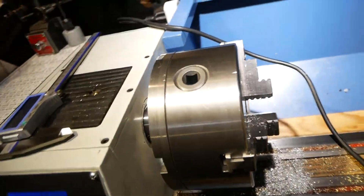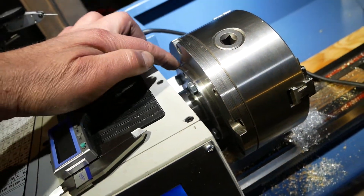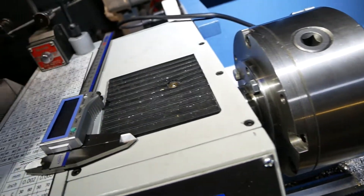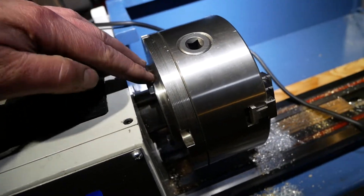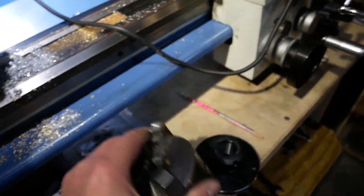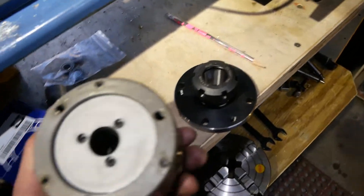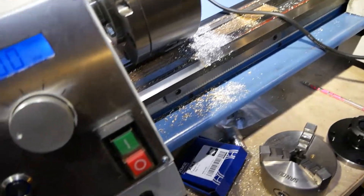What I ended up doing: this plate right here is part of the whole entire spindle assembly for the lathe. It's not something that's removable — it doesn't thread on — it's actually part of the whole entire shaft assembly. So you don't take it apart; it is what it is. All you can do is bolt onto it, which is how I did it. Those three bolt holes right there have bolts you can put through and bolt the three-jaw chuck on. This inside shoulder right there is a registration shoulder so you can get the chuck on and be pretty close to concentric.